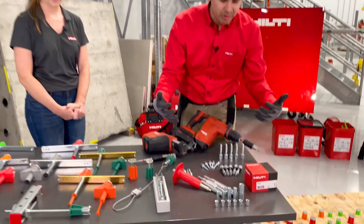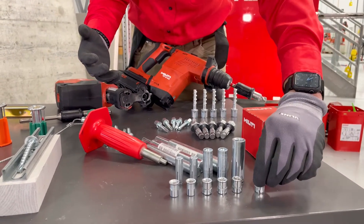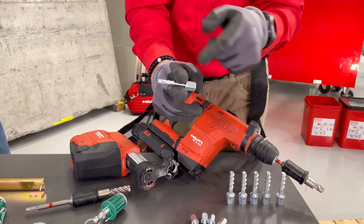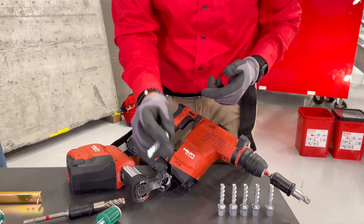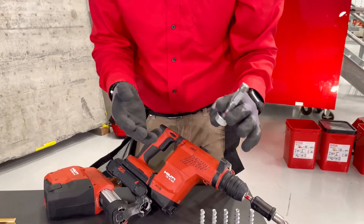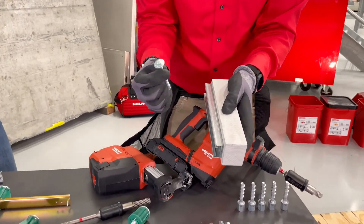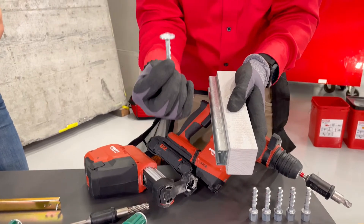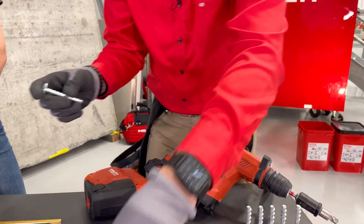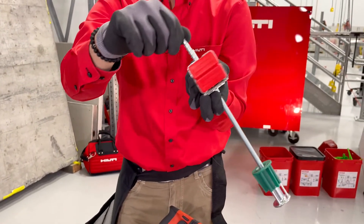The breadth of this portfolio is quite extensive, but I have a few on the table to talk through. There are flush anchors or drop-in anchors, such as the HDI-PTZ for a 3/8 rod drop. There are also screw anchoring solutions, which are very popular for speed of installation — we pre-drill the hole, install with an impact, and then we have our quarter, 3/8, or half rod drop applications. There are also wedge anchors for seismic bracing attachment if we're in a seismic zone. And for strut-to-concrete applications, there's the Kwik EZ Pan Medium and Pan Large head anchor, which comes with a pre-installed nut and washer so you don't have loose nuts and washers. We take our strut system, insert this anchor through it, and fasten it to a block wall or concrete ceiling.